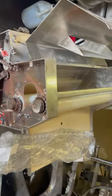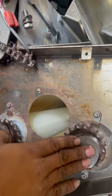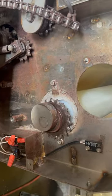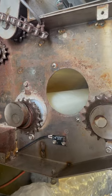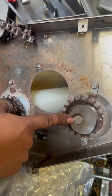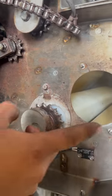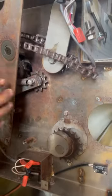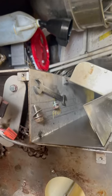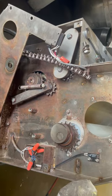Making this short video today just sharing my experience with these units. When servicing these sheeters or replacing the rollers, for example, the upper is a T20, the lower is a B20, and the middle doesn't have a marking because it's pretty standard. Upper and lower require your attention — take pictures of the position of the roller. These rollers are held by a plate and two screws at the top, two at the bottom, and one in the middle. We're also replacing the chain on this unit.